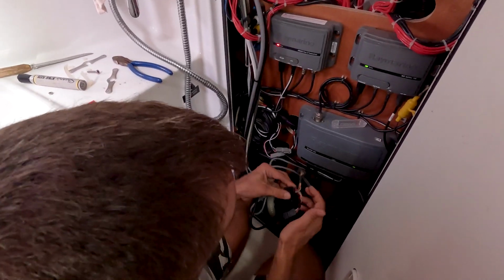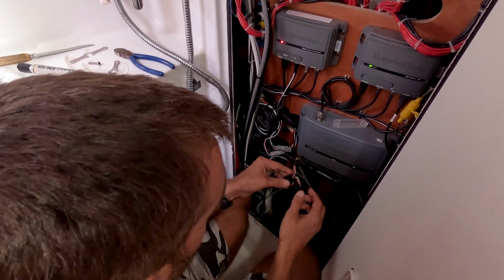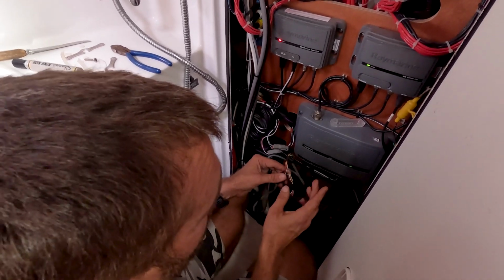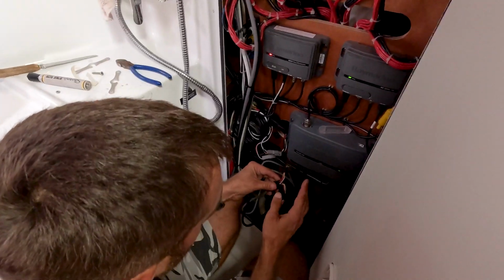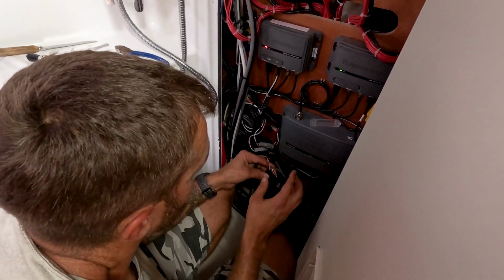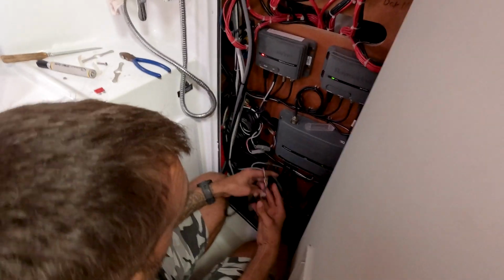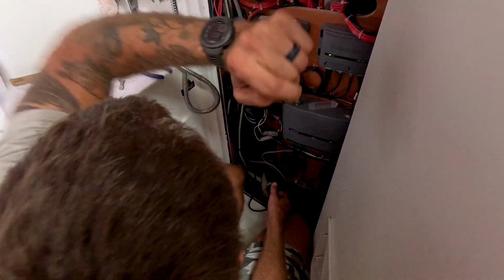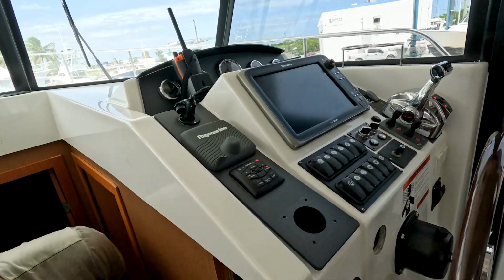So the first thing I did was switch these to see if the fault moved at all. The fault did not move. Both of the switches could still control it with these switched, but this downstairs one did not light up. So that left the control cable, a possible break in the wire, or the switch itself, the LEDs being burnt out.